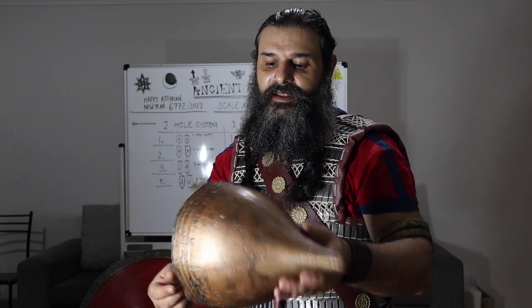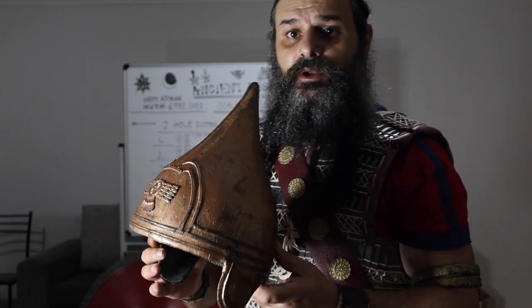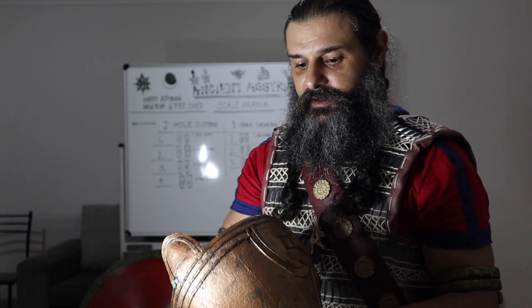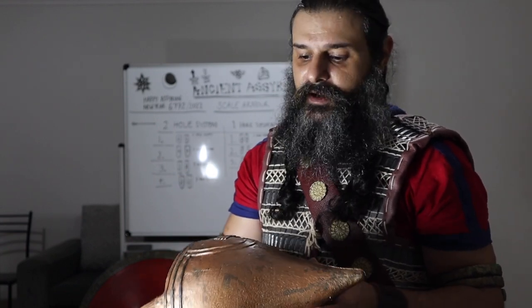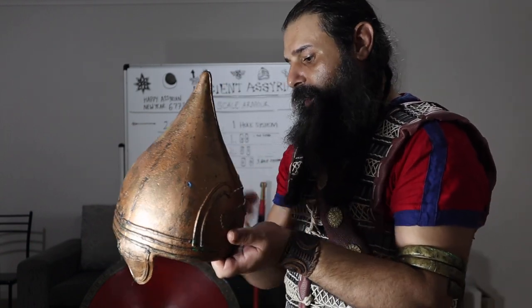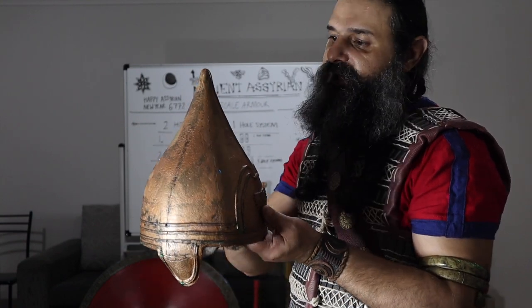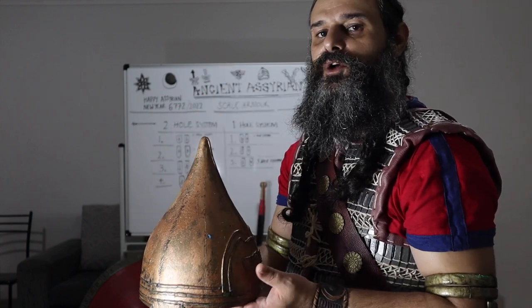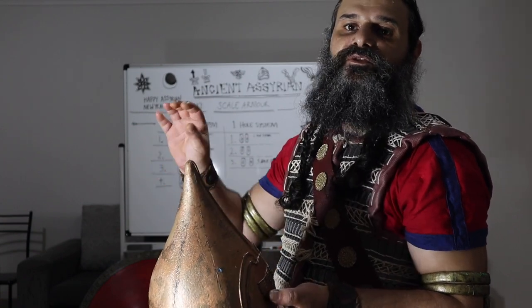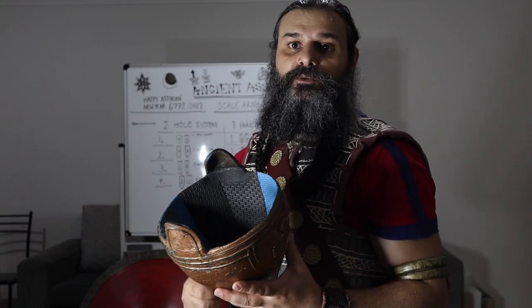So it's not that complicated really, but you just need a little bit of skill with a blade and an outdoor setting to use the contact cement to stick the pieces together, and you're done. These are very simple, but this is what I used as, for example, my base. I put a rim at the bottom, glued it down to a base, which allowed me then to start creating one half of the silicon mold, and then the other half of the silicon mold, and then the hard shell on one side, and then the hard shell on the other side, and then after that pull it apart, put it back together, mix a bit of resin, put it into the mold, and then rotocast the whole thing to be able to produce the resin copies as well. So not bad.